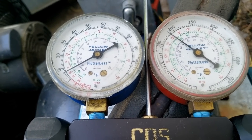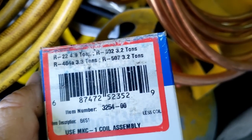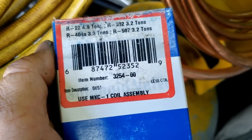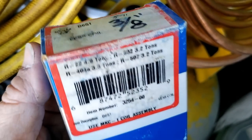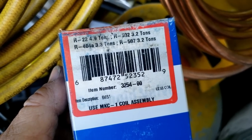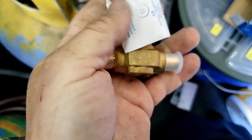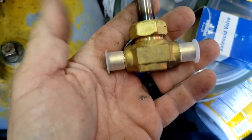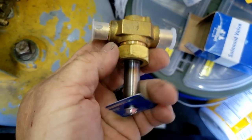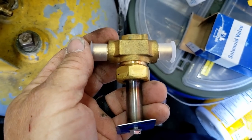She's going to come back on for another go around. We've got a Sporlan valve here - 3/8 inch, good for up to 3.2 tons, which I know this is not a three-ton unit. It's not quite the exact type of mounting system - this one uses a screw-down coil, which we tend to use more often because they're more secure. One thing I don't like about this one is it's brass directly with no copper in between. I've got to use high silver content braze alloy. At least you can rebuild these, unlike the cheaper ones that just have a copper stub.